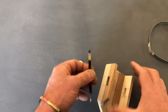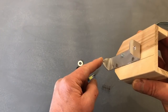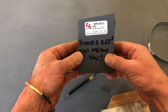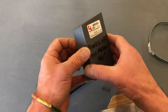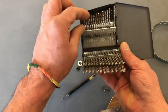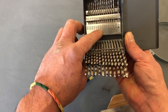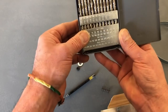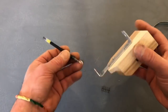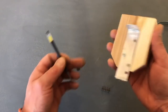The second hole you've got to drill is up top — these are lined up — and you make that a little bit bigger than the body of your pen. To drill little holes like this accurately, I recommend a number drill bit set if you don't already have one in your shop — they're great to have if you do a lot of small detailed work. Each drill bit has a corresponding number and a fractional decimal point of what it truly is. They're very good to have and you can match drill bits up a lot easier than fractional drill bits.